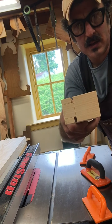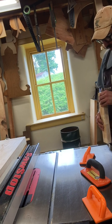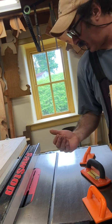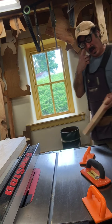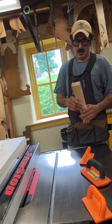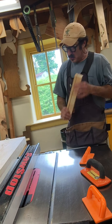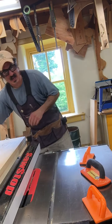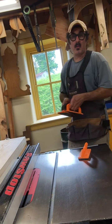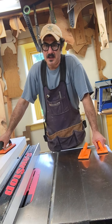So those cuts look real nice. I'm going to make the same cuts on the ends of the shelves and I think that's going to work out well. There's no chip out — using a single blade here. The dado blade a lot of times we have more chip out. And it's also going to give us a smoother cheek. It's a nice crisp shoulder, so we're going to bring a shoulder and a cheek onto this. I'm going to go ahead and run these through, same exact way. And really the reason we're allowed to do it this way instead is that we have flat boards, and that makes a big difference.